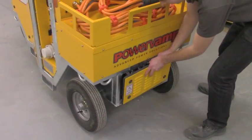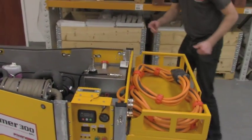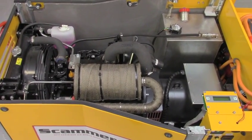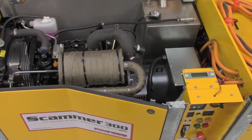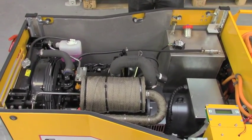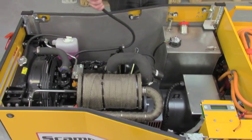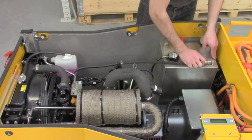As well, we've got a 33 liter fuel tank, which will have enough capacity to run the engine for around 10-12 hours. The fuel tank is fitted with quick fittings, so if you need to replace the fuel tank, take it out, or drain it to do any air transport, you just take those connectors out. You won't spill any diesel, they are very easy to remove. You put it back again, just press it.